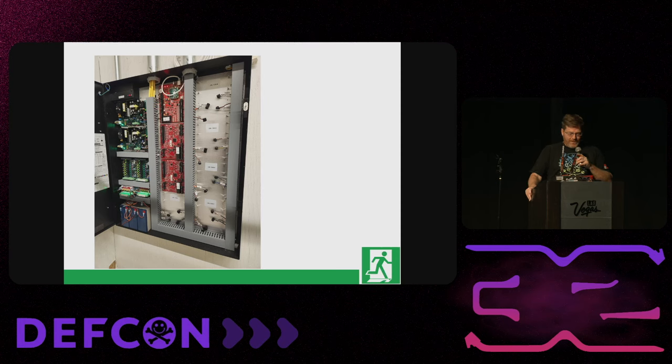This is a larger installation with power supply, batteries, the access panel at the top with an Ethernet drop, and two door controller boards below. In centralized panel situations, you typically use an enclosure with six or eight door controllers — each controlling two doors — kept in one or two enclosures right next to each other. The RS-485 runs are really short; in a pre-wired panel you don't even have to mess with it. This gives you extra security instead of running a door controller way across the building where all that wire could be a problem.